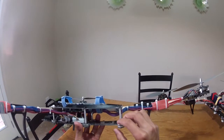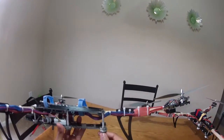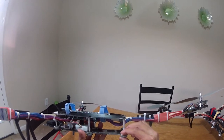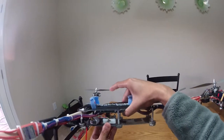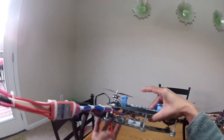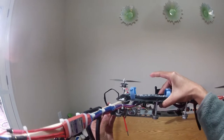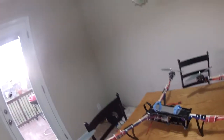An important thing is when you're tightening these shock dampeners down — don't tighten them all the way. A lot of people tighten them really hard and that compresses the foam so much it doesn't have any room to dampen anything. You want it to be able to move up and down, but not completely freely. There's going to be a GoPro on it, so you want it to move pretty freely but not too freely, just enough to dampen the vibes.